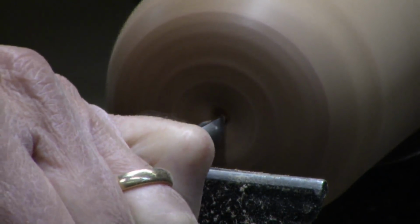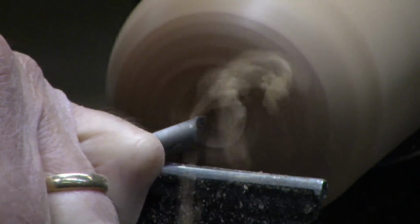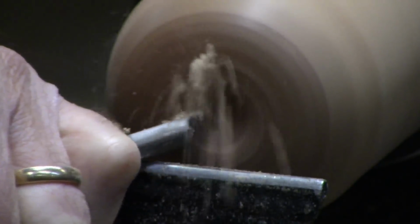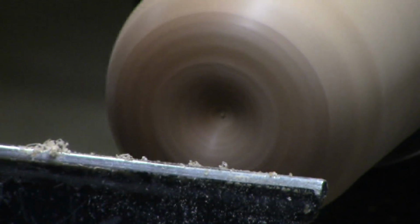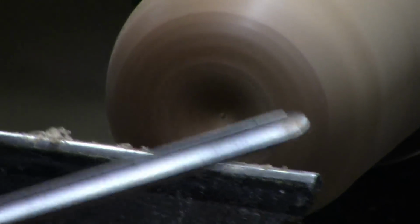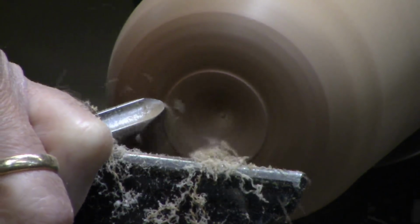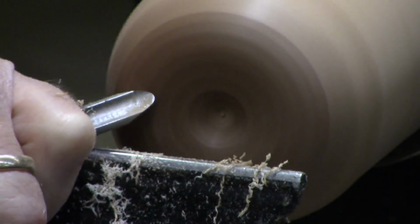Then I'm turning the tool over, bringing the handle around toward me, and then coming out, okay? And I'll do it again. Drill in. And come back out. Coming back toward the high point, okay? Everybody see that? And now I usually like to actually make this other cut all the way down. Let's see how this goes. You can hear the grain of this red oak. Maybe not the best choice for something that's mic'd up.